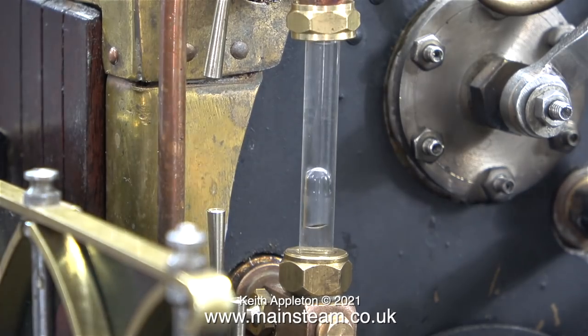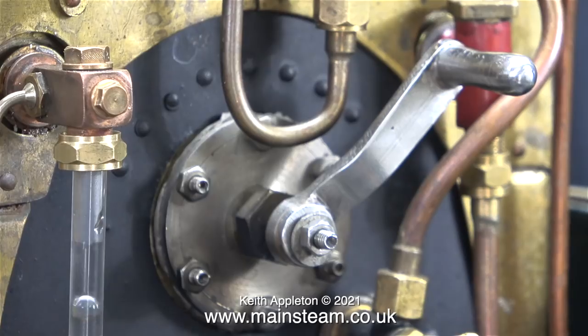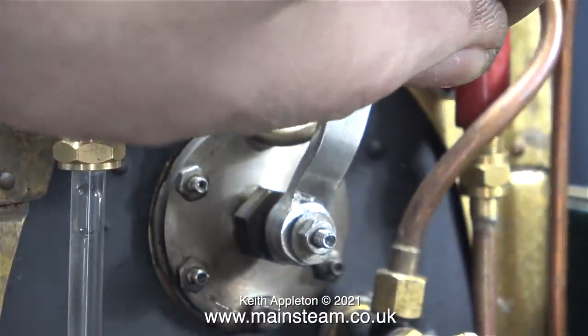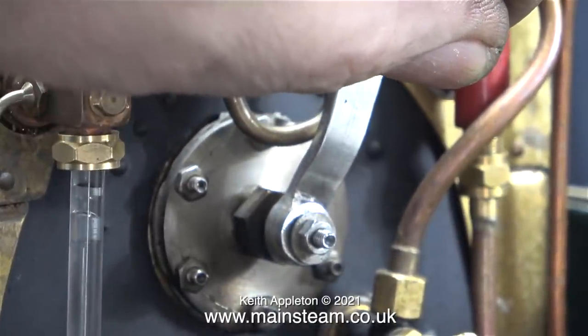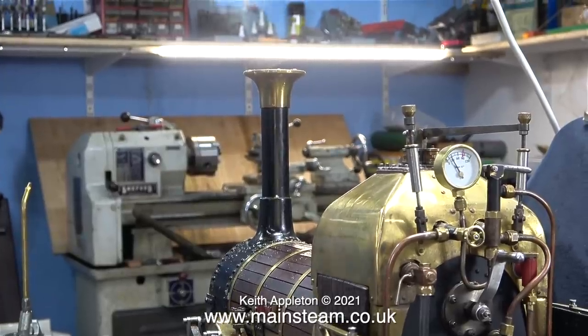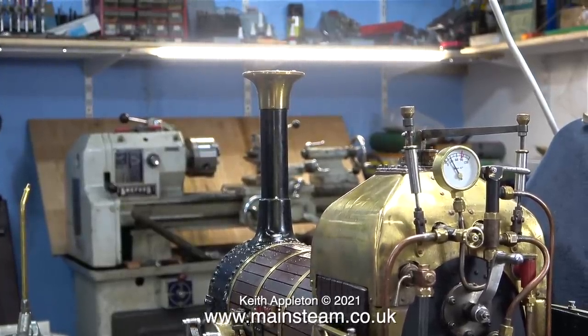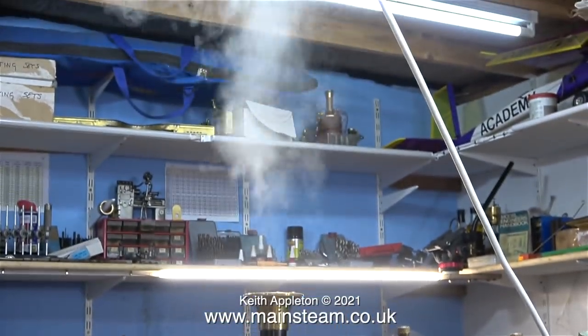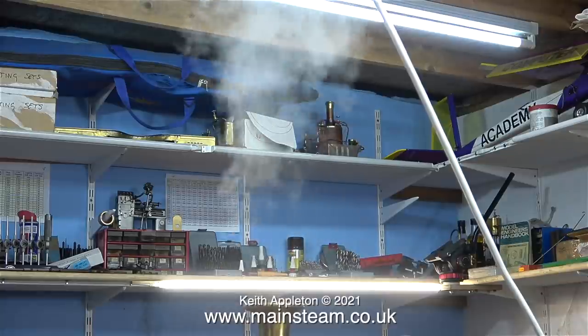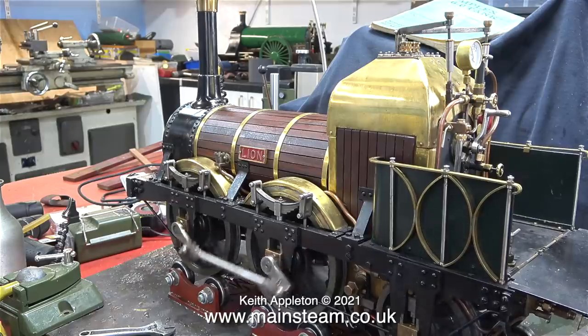The injector is still pumping water into the boiler and the pressure's not dropping much at all, and it's only fired with a little gas burner in the firebox. Time to open the regulator. And as I haven't opened the drain cocks on the steam chest because right in front of them are some pieces of electrical equipment, I'm now getting a shower bath. But this shower bath doesn't last very long, and the steam oil will probably do my hair some good.